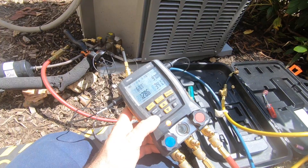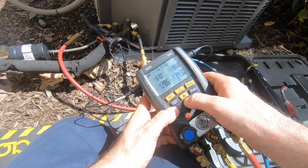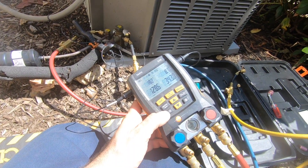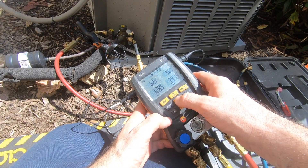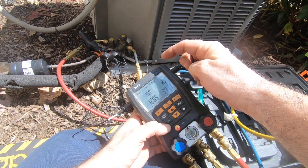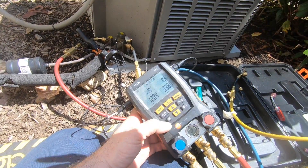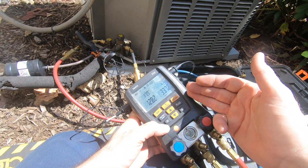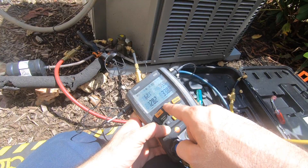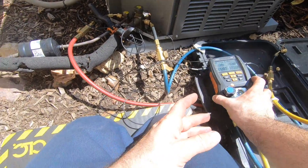As you can see — maybe the probe wasn't sitting that good. As I move my probe, I'm down to 63, still dropping. Maybe I needed a little time. Superheat's now 18.4, 8.7 as I'm equalizing. My coil's getting colder because it's probably cooling the air upstairs. 62.6, still going down. To increase your subcooling, you add gas. To reduce, you need to take out gas — let it out. To make it go up, you add, and your subcool goes up and your pipe temp goes down. We're 62 degrees on our suction. 17.9 superheat, 9 degrees subcool — that's perfect.